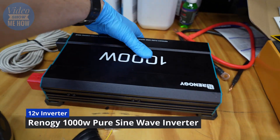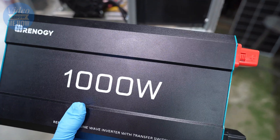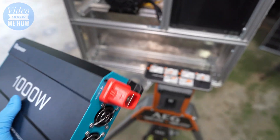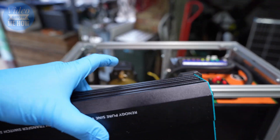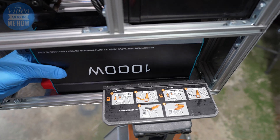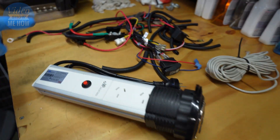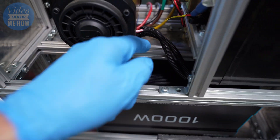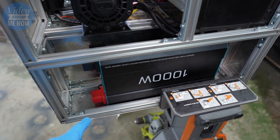Last part is our inverter. We just need to orient it the right way — there's a handy slot down the bottom that fits it perfectly. The exhaust fans are on one side with plenty of cable length, and the plugs are on the other side. We'll put a little inlet vent on one side similar to what we did at the back of the compressor, then shimmy it in so we have enough room to plug in the cable. We can run wiring up and through to the battery and the shunt. That's our final bit of gear to install.